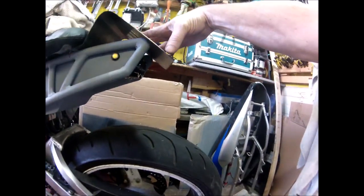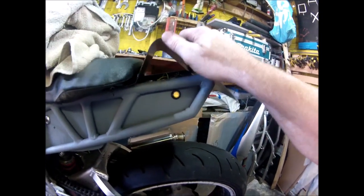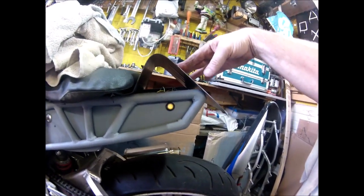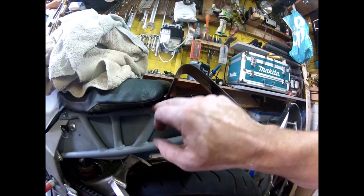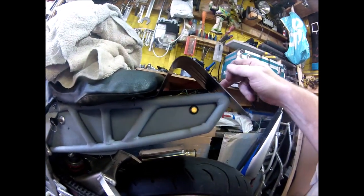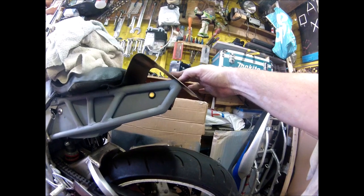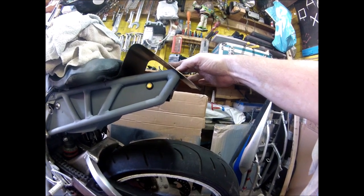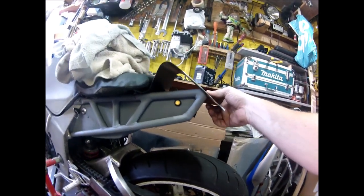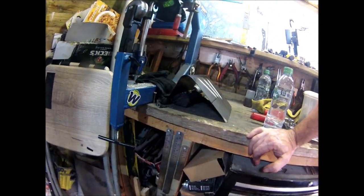That return across here will create the lid over the top of the lights. This edge will be shaped in and then a side panel put either side to box it all in. This front edge will be rivet nuts, bolted down so when you take the seat away you can undo it. Not sure about the back yet. Initially this has to be a very tight return so I'll have to make something to fold it with — it comes to something when you've got to fabricate your own jigs to fabricate your own fabrication.